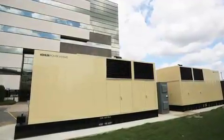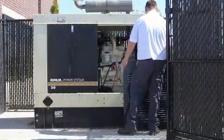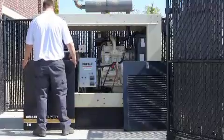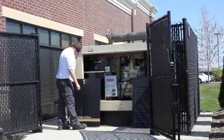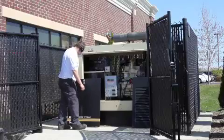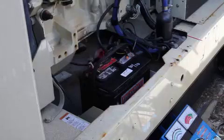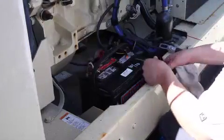Battery failure is one of the most common reasons emergency generator sets fail to start. Maintenance of the generator starter set's battery is critical to ensuring sufficient ampere capacity to start the engine. As a precaution, generator users routinely change out the batteries every 2 years. Choosing the correct battery and maintaining it properly can prevent the majority of battery failures.